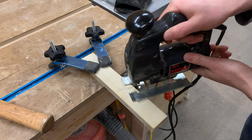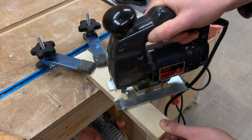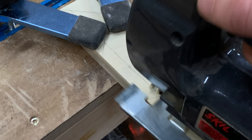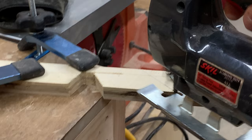Now all you need to do is cut out the shape. You could use a bandsaw and I'd probably recommend that, but I just pulled out my jigsaw from the early 1990s that desperately needs a new blade. You could also do this on a table saw by beveling the blade. There are actually a ton of choices: a router, a Dremel, scroll saw, multi-tool, spindle sander, or CNC — but the jigsaw was the easiest and most handy for me.